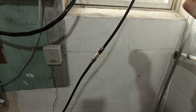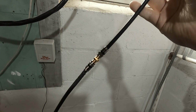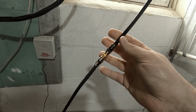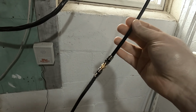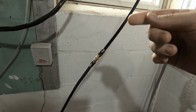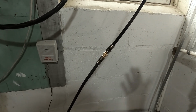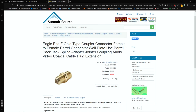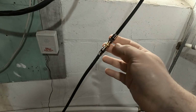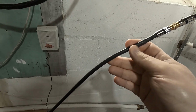All right, now we're in my basement where the line comes in, and you can see this is the outside cable coming in. This is our quad shield cable here. This is all aluminum shielded with the EMF wiring and everything in there to reduce the electromagnetic interference and fields coming in. Then we have an F connector here, and this comes into a quad shield Monster.